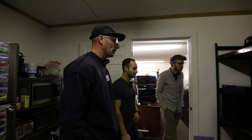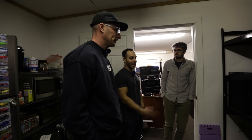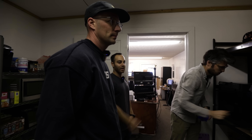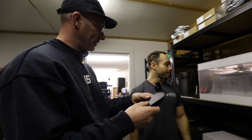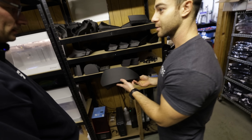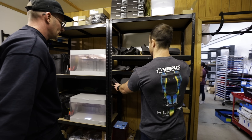These are our cheaper printers — more for basic and early prototyping. A print is probably five to eight dollars in material on this one; on the carbon nylon printer it'd be around thirty because the material is so much more expensive. It also prints faster — maybe three hours on that print versus eighteen on the other. The carbon nylon printers do a really nice job as far as strength. These are actually steering rack limiters for the Supra and exhaust cutout covers — that's basically what prompted us to purchase these printers. Then we found other good uses: splitter end plates, brake ducts, stuff like that.